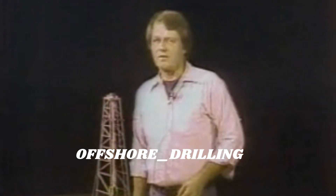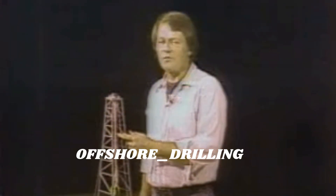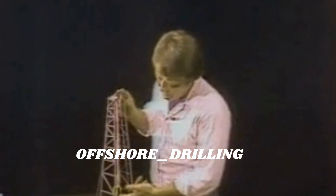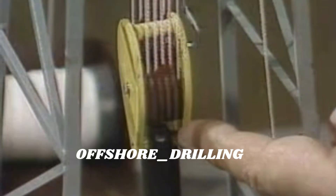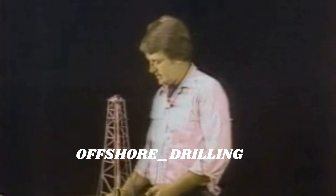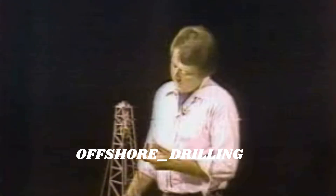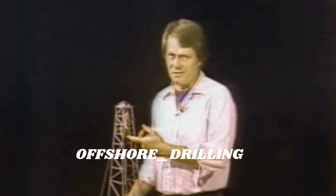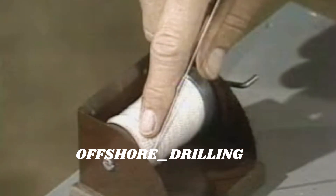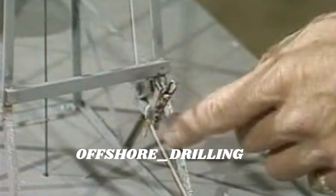Let's look at the rigging system of the rig. The portions of the line marked in red on our model are the critical points where the most wear occurs. These are on top of the crown block sheaves, the bottoms of the sheaves of the traveling block at the two pickup points — down here picking up the load coming out of the hole, and up here picking up the load going into the hole. There are other critical points on the line at the crossover points where the line begins a new layer on the drawworks drum, and at the deadline anchor.